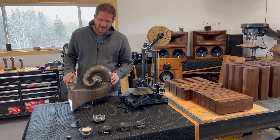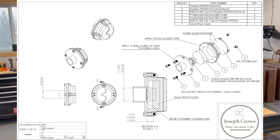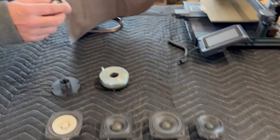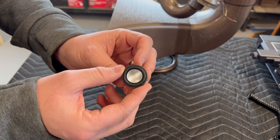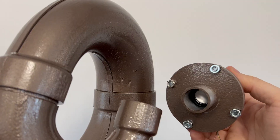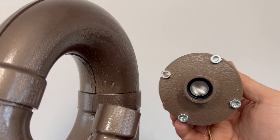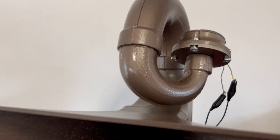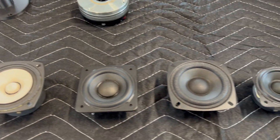The plan set on the site includes my own custom compression driver. After testing all of these different drivers, I settled on this little guy, which is a 19-millimeter full-range driver from Peerless. Inside there is the little full-range driver, and it's shooting directly into the throat. It has a tiny 0.05-liter sealed rear chamber, which I found was a good balance of low-frequency extension and also offers clean treble output.